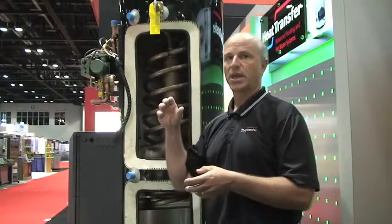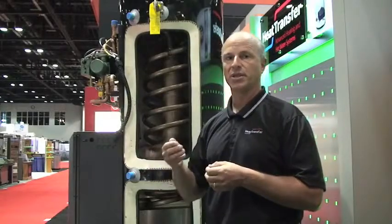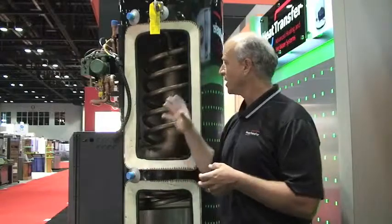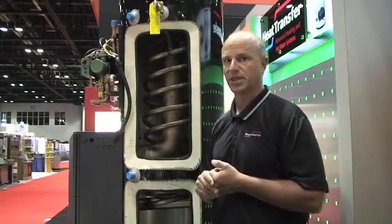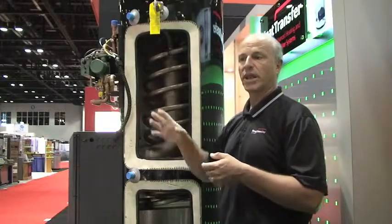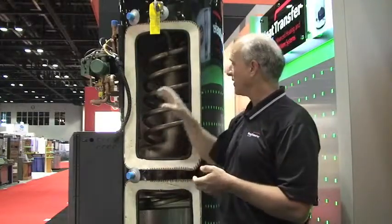recovers very quickly, and essentially we're reaching set point and we're not absorbing energy in the heat transmitters in the house itself. So that's one of the really key elements in this product versus some of the conventional high efficiency low mass boilers you'll see in the field. This product, with its hydraulic stabilization, not only helps on the domestic hot water production but also on the heat, because we have stored energy.